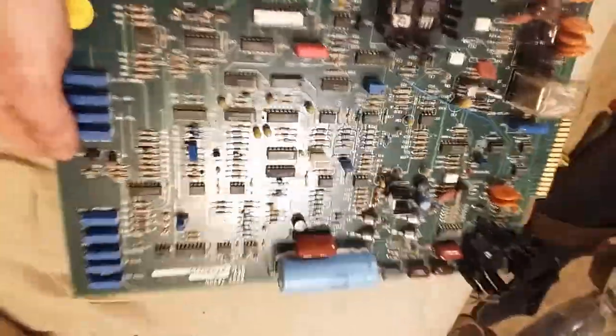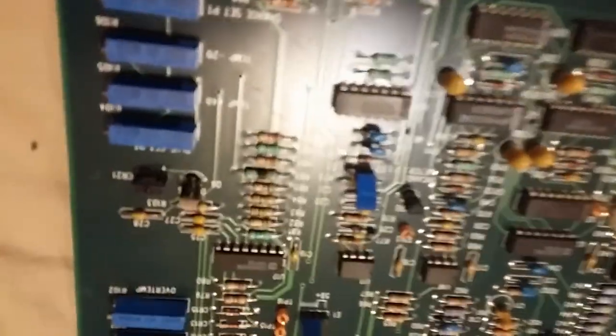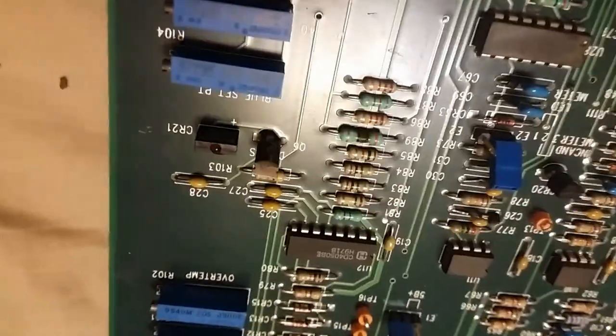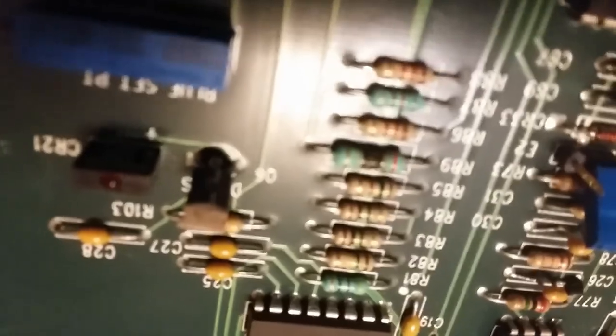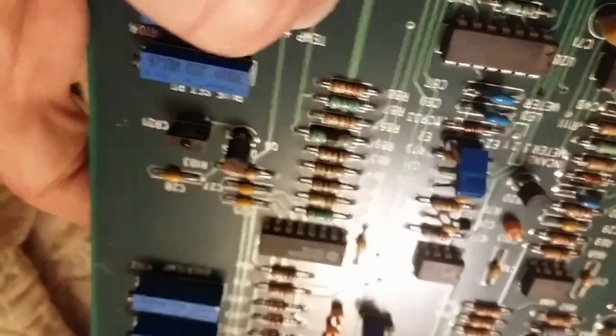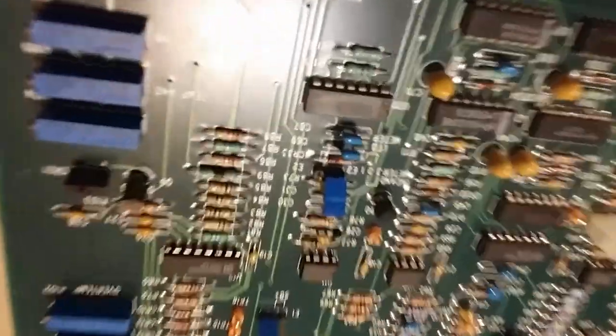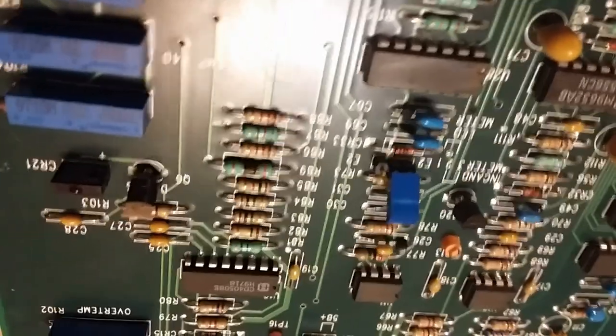I just wanted to add in where this board might have potentially failed, and it might have been why they scrapped this entire thing. If you look right up here, it's a resistor that is definitely being cooked, or been cooking for quite some time. Either way, not looking too hot. Maybe it's looking a little bit too hot. Ha ha ha, hilarious. Not necessarily the reason why this stopped working, but like I said, definitely not looking good.